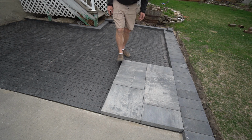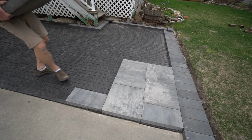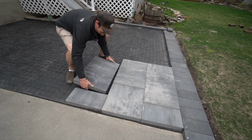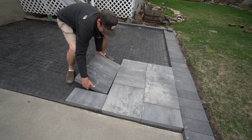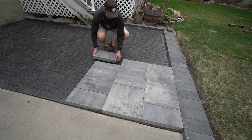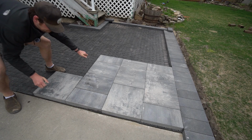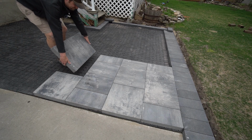I completely understated the advantage here. Hindsight after doing the whole patio, I would never do a large format paver on a straight sand bed. I tried dropping them right next to each other later so that they didn't have to slide, but it was almost impossible since they were so heavy. I started as a skeptic when Dad brought this stuff home, but this whole process has turned me into a believer.